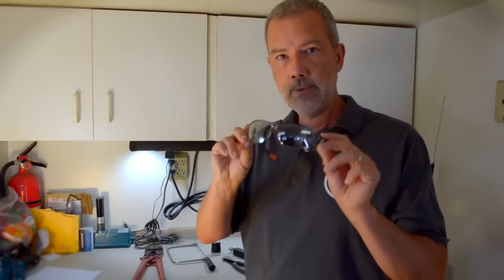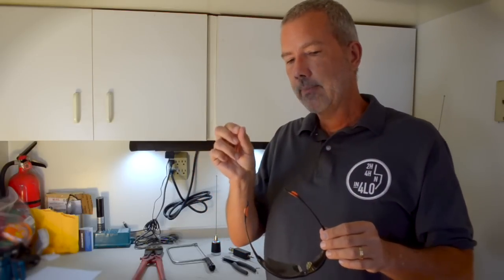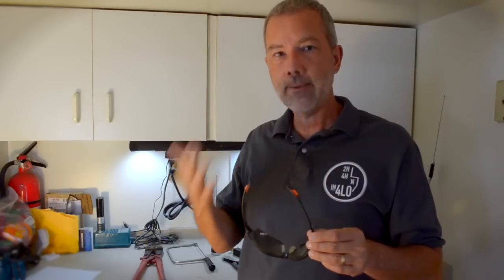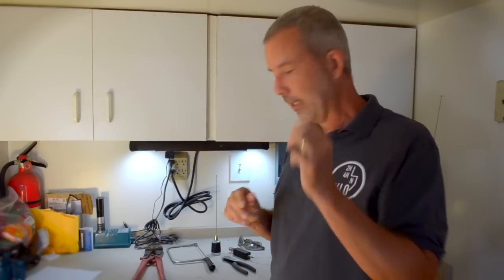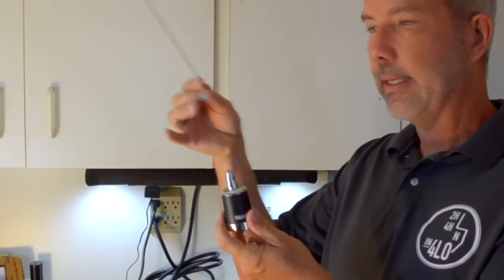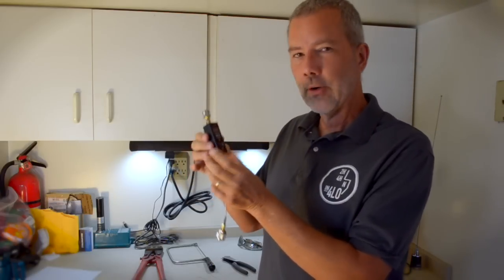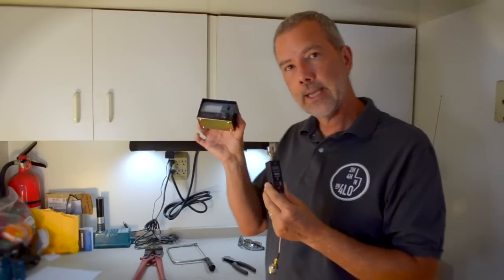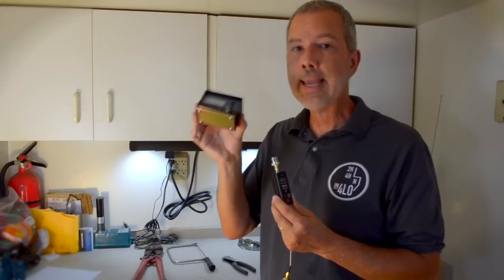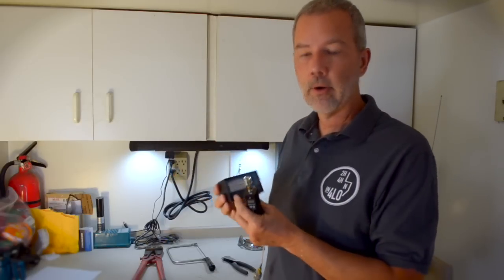So how do you tune the antenna? You're going to be cutting your antenna — shortening the length of it — and to do that you're going to need some tools. First you're going to need some eye protection. It's best if you have eye protection that makes you look cool when wearing it. When you trim the antenna the little bits tend to jump off like when you're clipping your toenails, and they seem to have an affinity for my eyeballs. You're going to need a little Allen wrench that should come with your antenna, to loosen the little mini bolts that hold the antenna in the base. You're going to need an SWR meter — this one I got off Amazon for about $35. It's super easy to use and it's digital; you don't have to do the calibration like you would on an old fashioned CB type SWR meter. You cannot use your CB SWR meter because CB frequencies are so much lower than the higher frequencies we use on GMRS.